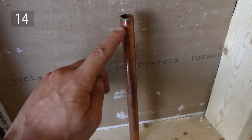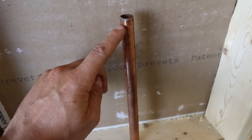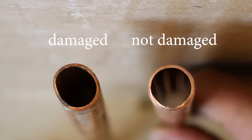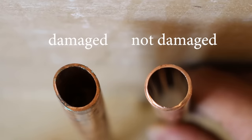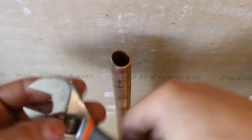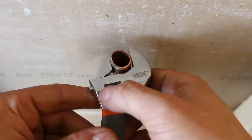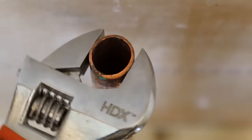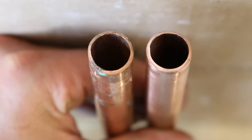Number 14 is what to do in case you have an out-of-round or oval copper pipe. This often happens on pipes that exit a concrete slab in new constructions and have been damaged and deformed. To make the pipe round again, just get your adjustable wrench and spin it around the oval portion. It'll force it into its original shape and allow you to carry on.